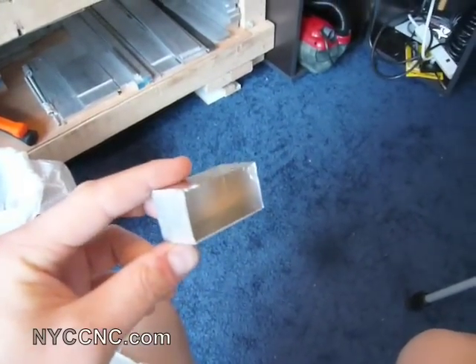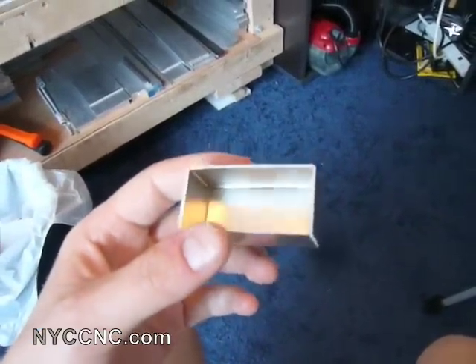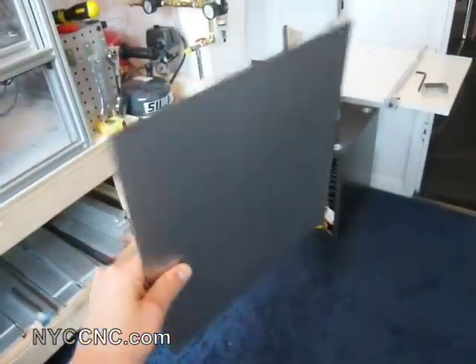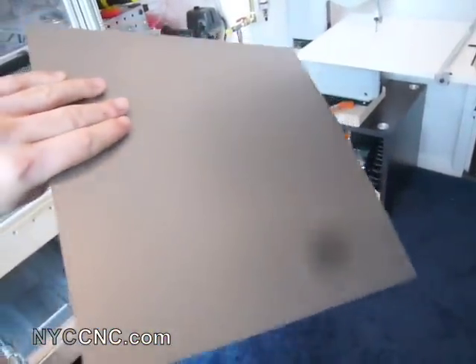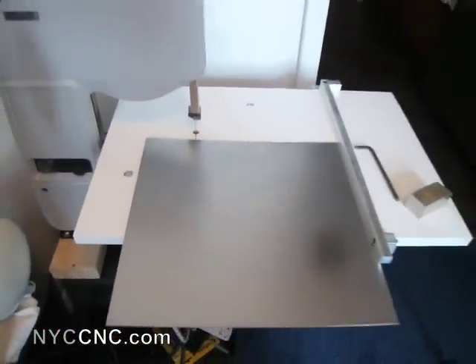This is a project where I'd like to make a larger version of this style of box out of 22-gauge sheet metal. I've picked up a piece from Home Depot — just locally available stuff. I've gone ahead and scribed a line three inches in using my calipers, which will give me the appropriate leftover piece. I'll then need to cut the corners out and set up for the box and pan brake. I've got my bandsaw fence set up to cut that line perfectly.